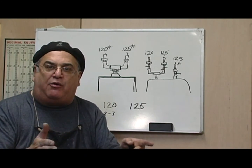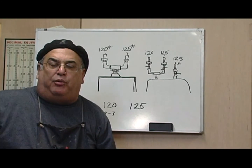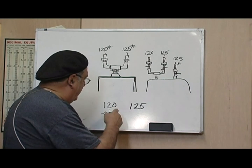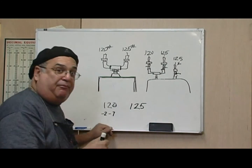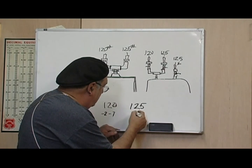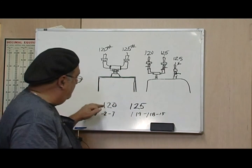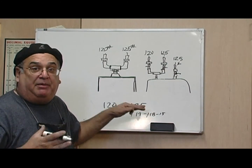But yet we got some of these narrow-minded, narrow-gauge, tunnel-vision guys — what they read in books. Wrong. The prototype boilers run on 300 pounds with half-inch sheets. We've got quarter-inch minimum and we're running a third of that or half. So you got 120. When this finally pops and it's trying to reseat but the pressure's still building and you get 125, this one pops. The reseat should be below this one here — so it should reseat at, say, 118-119, and 115 to relieve the pressure down below the first primary valve. The secondary valve is there to relieve the building, building, building of pressure.